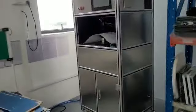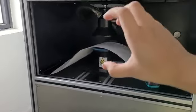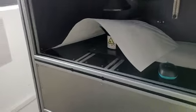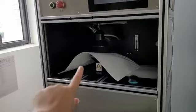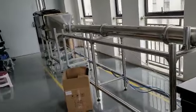One machine is to test the raw materials when the supplier sends them. For HEPA, you cannot recognize by eye whether it is H11 or H13, but this machine can help you. It has a very strong fan, and it runs for a set time to calculate the removal rate. For H13, it should be 99.97% for removing particles.